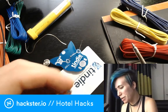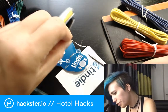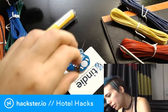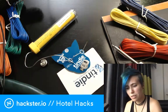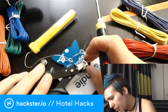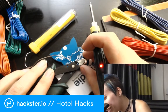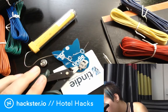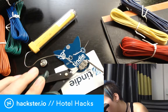Maker Faire starts tomorrow, so tonight is all about building stuff. I'm going to tin the pads first, then attach the battery holder. I'm using a wire cutter to hold it in place since I don't have my usual tool set. Now that the pads are tinned they're little bumps, which makes it hard to keep the piece in place. I probably should have tinned the battery holder as well first, but this is where we are — we're going to live with our choices.